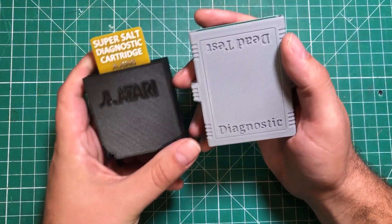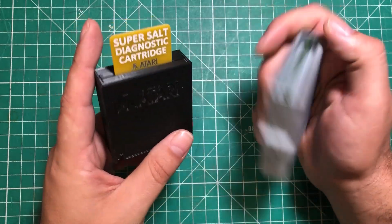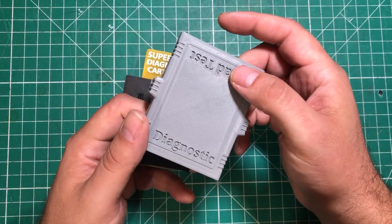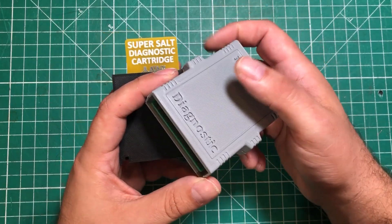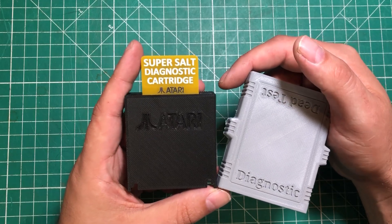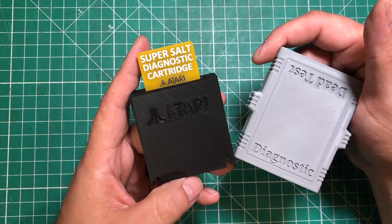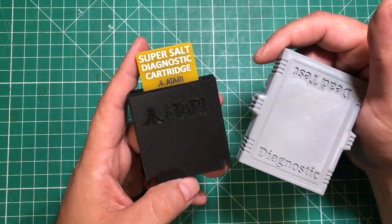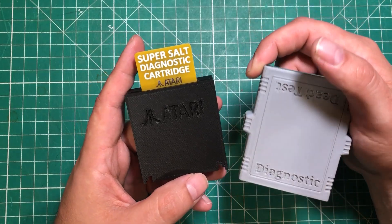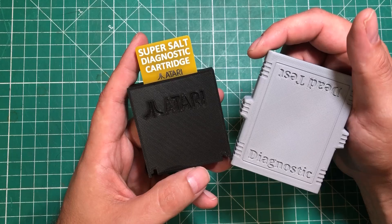If you've watched my channel, you know that one of the things I absolutely love to do when I work on a new machine is to make a diagnostic cartridge for it. This one is for the Atari 8-bit computers, programmed for the XE. This one is for the Commodore 64 — we've got a dead test and a diagnostic cartridge. A lot of times when you get an old computer, you don't know if the floppy drive is going to work, but this gives you a quick test and starts pointing you in the right direction. It's a good way to test the keyboard, the sound, and the overall RAM. You don't want to have bad RAM in upper memory and not run into it until you play a certain game.